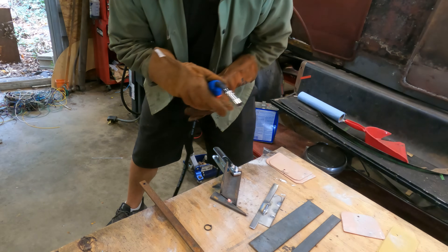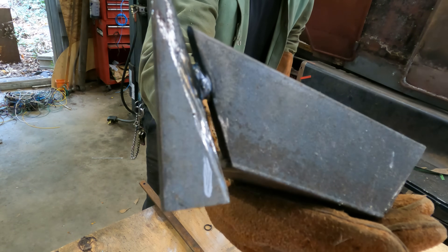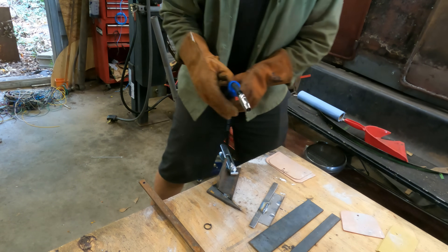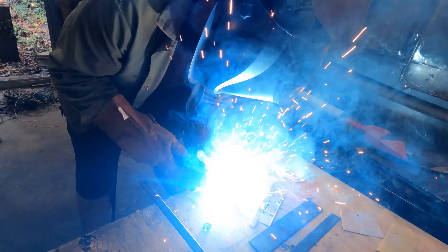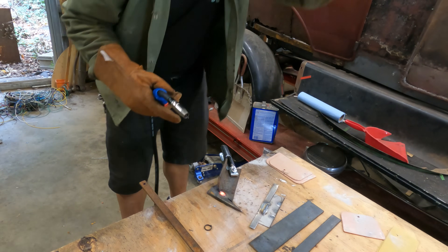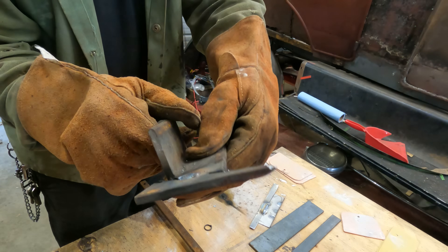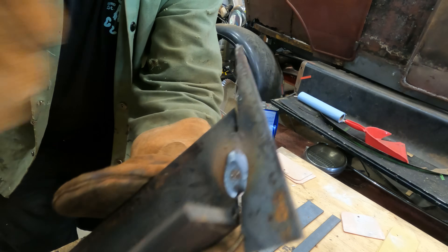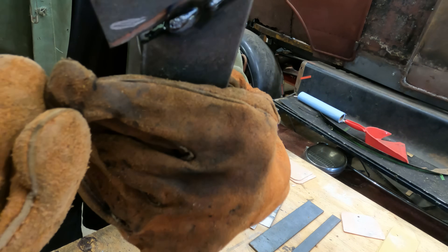Hot out the gate. That's getting pretty deep in there from cold metal. It's burning through this — no problem. What you can see is it's keyholing the quarter inch material. The keyhole is the wider spot where it's burning it away. I was running too hot and moving too fast — that's why it looks the way it does. But right out the gate, you're going to be able to do quarter inch material with this thing at 160 amps.